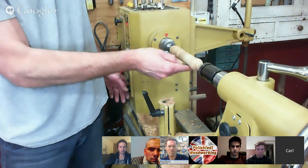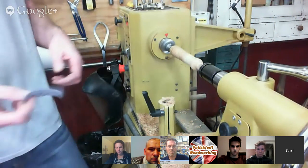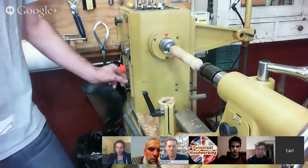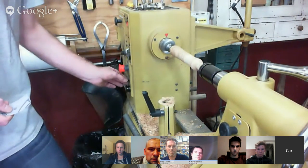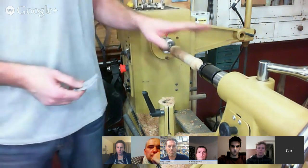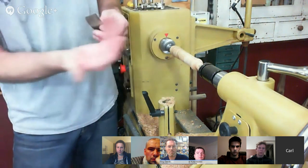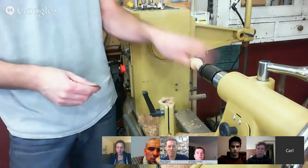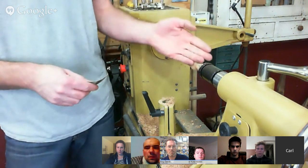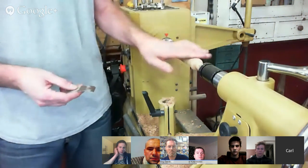So start out at 180, and then I'll switch to 200 or to 220, and then go back, reverse the lathe. So, I'm not sure if you can see that. There you go. Can you see that? I always go back and forth, and the reason is, if you just sand in one direction, you're laying the grain down all one way. So it's just continuously laying the grain down in one direction. So if you reverse it, it lays it down one way and then pulls it back up and sands it off the other way. And I just go back and forth all the way up through 600 that way.